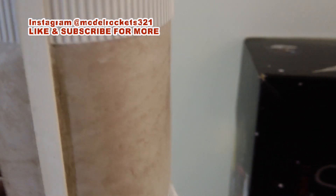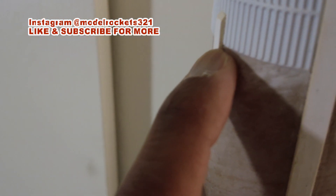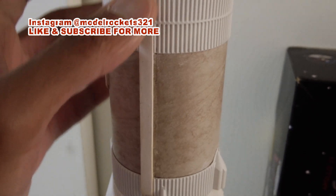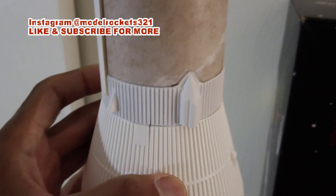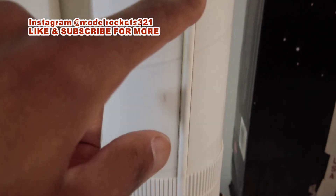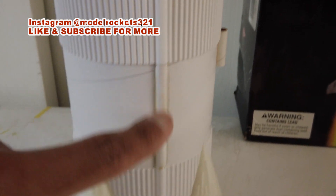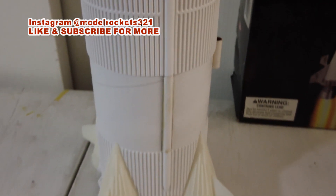The technique I had to use here I've never done before — you had to sand just a little, probably half a millimeter, just to get this to sit on top of the shroud up top. Just sanding and getting things beveled. I'm going to go back and fill some small gaps here the best I can, and then sand — that's going to be the next step, getting all those little things worked out before I go to primer.